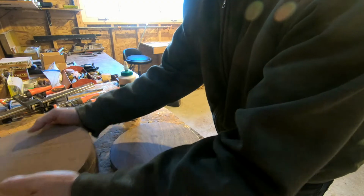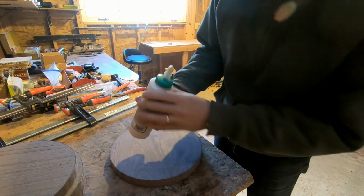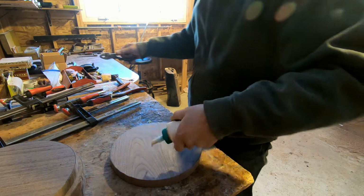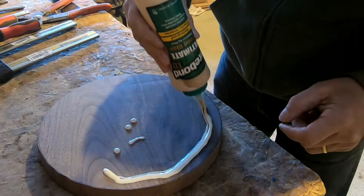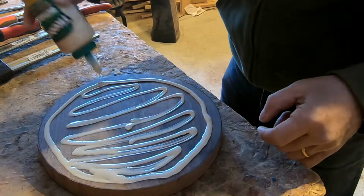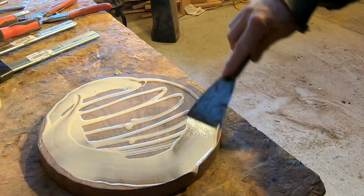This is the order, and I'm going to cross the grain at each layer 90 degrees. Going to be wasting of necessity a whole bunch of glue because I'm not really sure what shape this thing's going to turn out to be. And so I won't know which actual minuscule percentage of this surface is actually going to be in contact by the time we're done. So better safe than sorry.